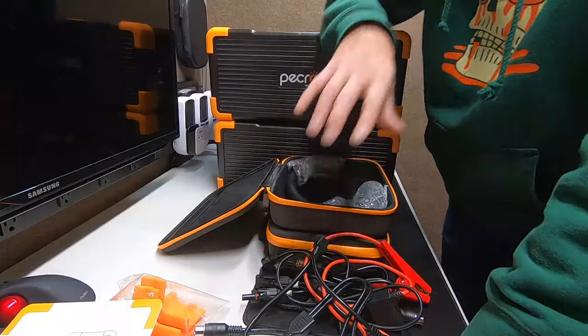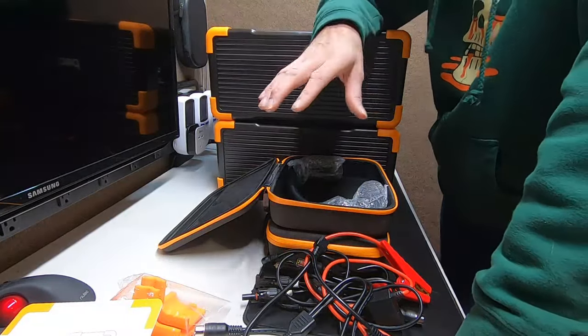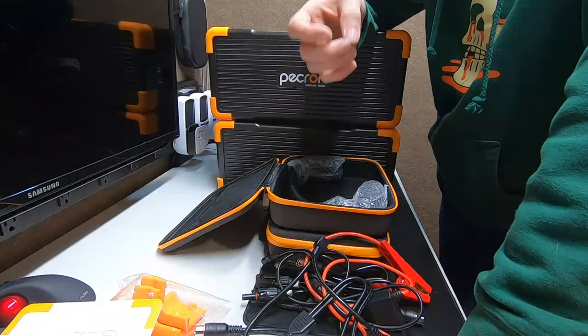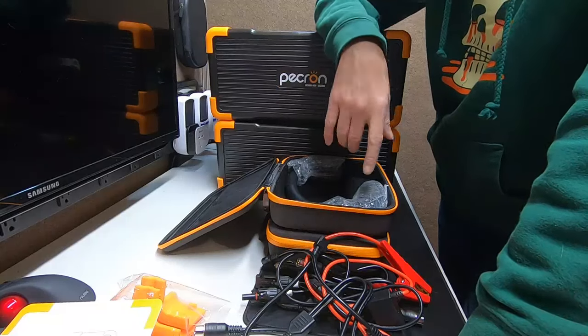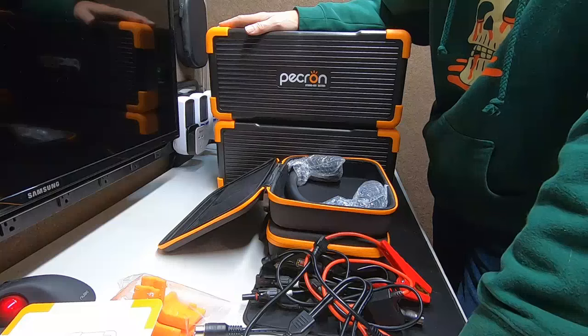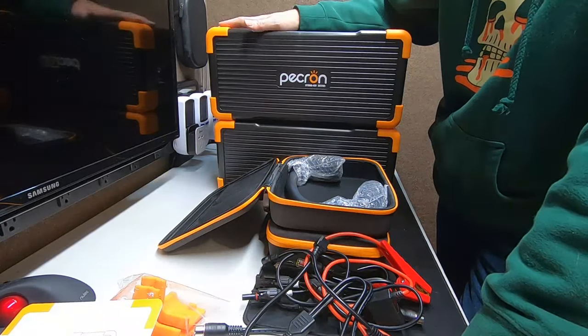One is I haven't tried the system yet, but I don't think that the inverters or the MPPT controllers like that high voltage. This one could be different. That's what the tests are for, guys. So we're going to do, obviously, another video later. I recommend staying under 80 volts.